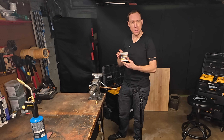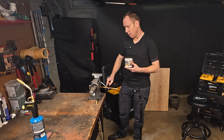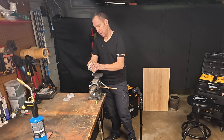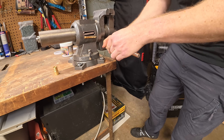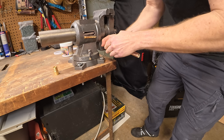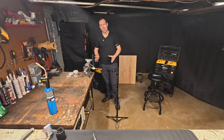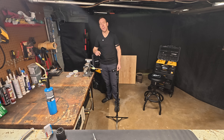I'm going to use the heat sink putty for this application. If you have any other fittings downstream that you don't want to unsolder, put this on as a thermal break. The directions say to apply it pretty forcefully, so make sure it's really mushed on there. There's also a goop you can use, but it gets pretty messy — this putty is pretty clean and stays on tight. Once you're done, you can put it back in the container and reuse it.